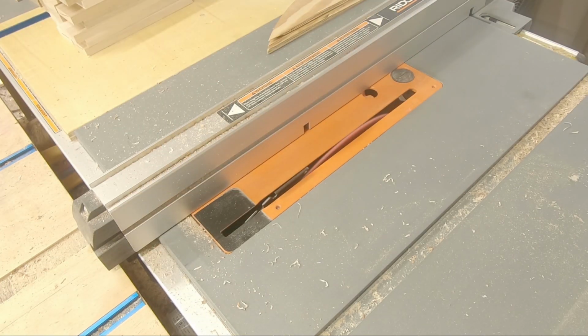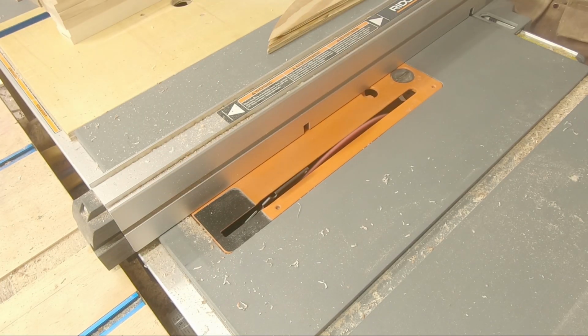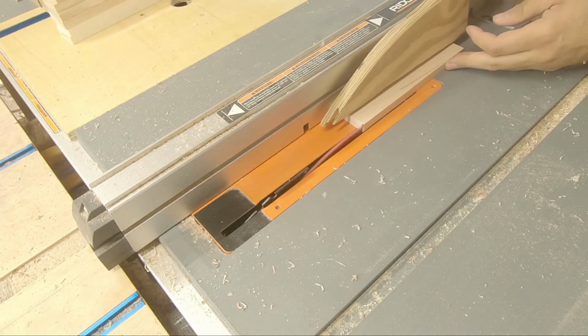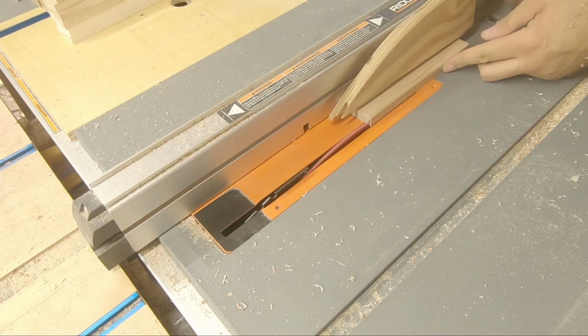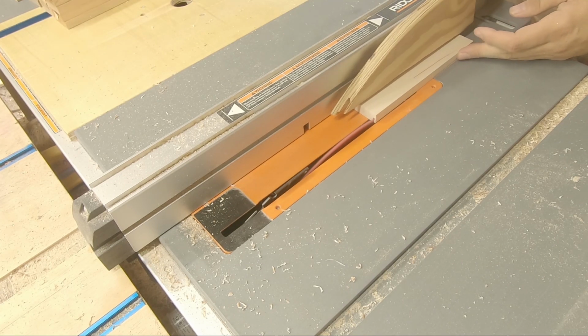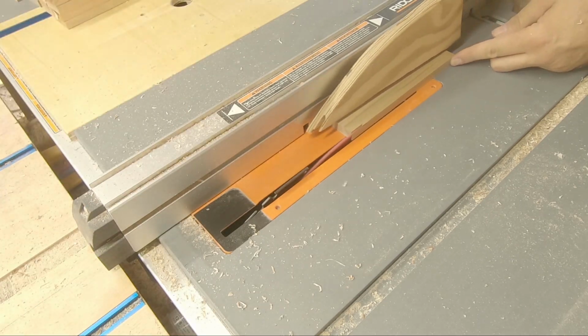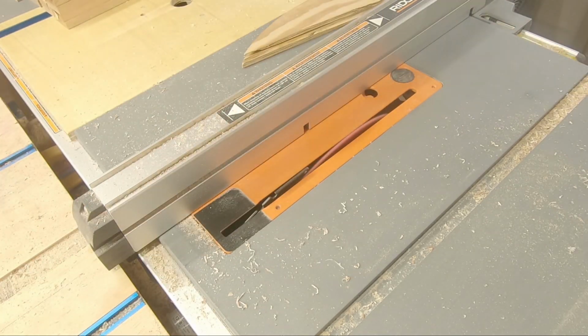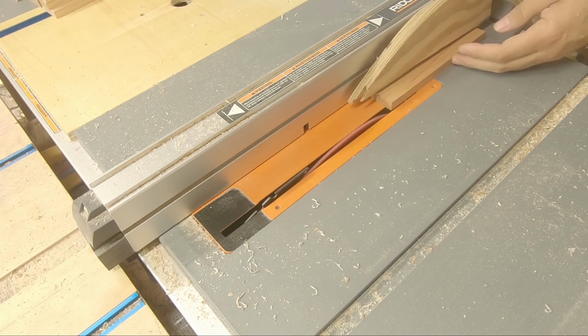The nice thing about cutting bevels is that you don't need to adjust the fence to cut the matching bevel. After cutting the bevel on one edge, just flip the board around to cut the other edge. As long as you measure the width of the cut from the top of the cut to the fence, the bevel cut will remove the lower section, keeping the upper face the same width all the way through the board.